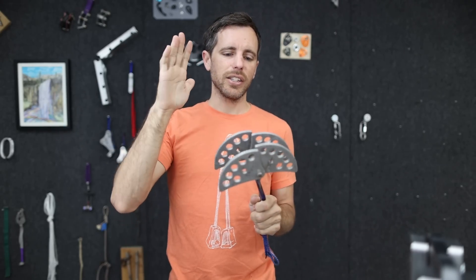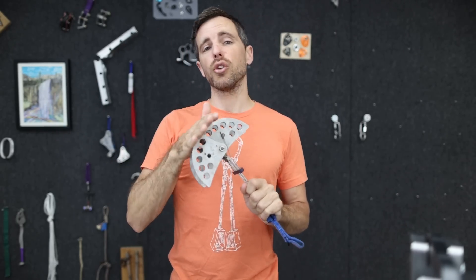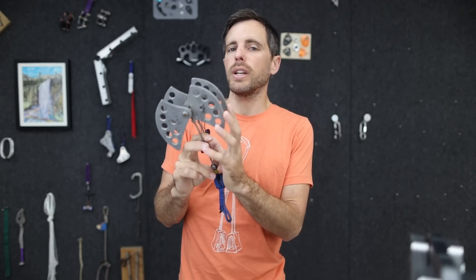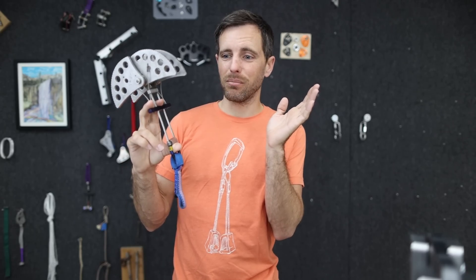The concern is that the cam is putting out a lot more force than you're pulling on it. So if I'm doing one kilonewton down, is it doing two, three, four, five, six kilonewtons outward? I love testing things because I've seen people discuss math that gives wildly different answers, and they all sound very confident. It's also not easy to calculate, based on watching people try it.